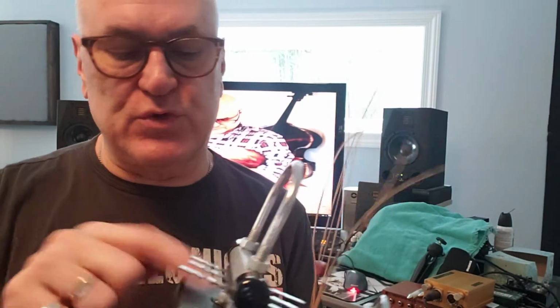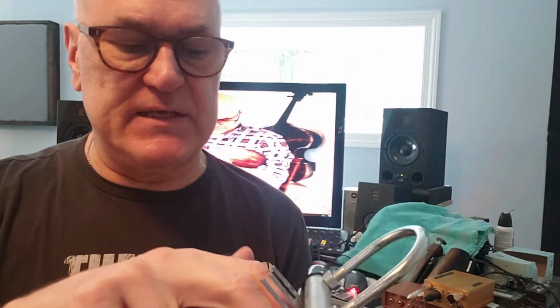So where I had problems, and this is where I thought that Kent had an advantage, because you had the front and back support of a U-shaped device channel underneath, is, so when I first did it, I screwed in, oh, well, you know, it's got a brace, so I'll screw the brace in against the things. They weren't tight enough. They were like sort of held, but not really. They were rattling a little bit, and you don't really want saw blades rattling around a little bit.